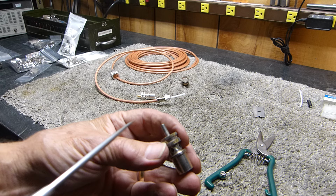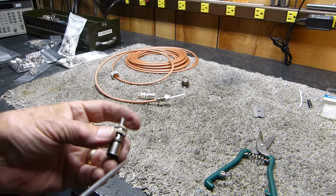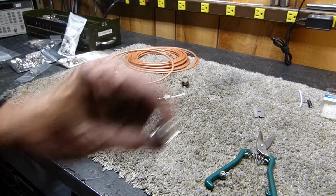Okay, I got a bunch of old ones that I've cleaned up really nice. These are even harder to see, but if you look down in there, this is not Teflon. It's phenolic, I think. The pin here is recessed. I can see it clearly. Can you see it? So if this presses up against this, it's not pressing against anything conductive, because this pin doesn't go all the way back to the very end of the dielectric like this does. Problem solved,